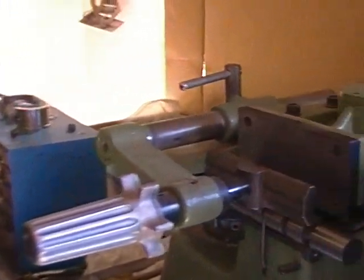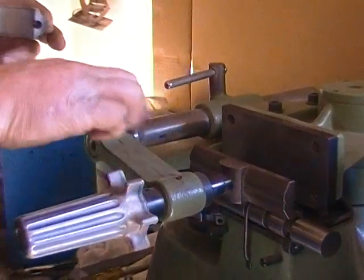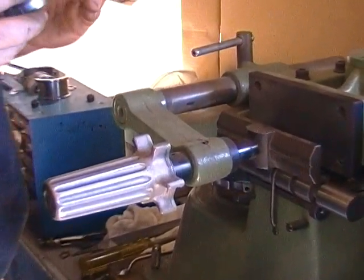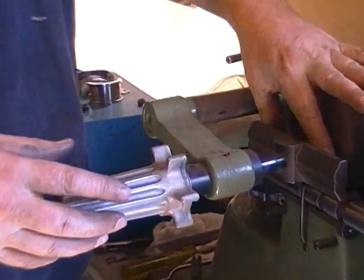What we're going to use is a specialized machine called a cap grinder, which uses a stone and a level rod to exactly set the cap up. We'll be taking off about two ten-thousandths to three ten-thousandths at a time as we work the cap on the machine.